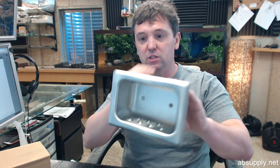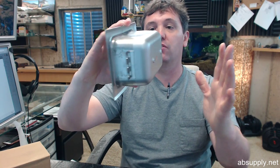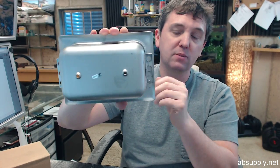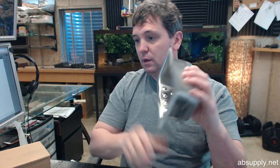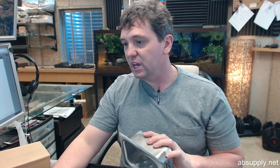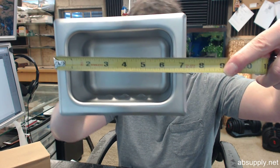Intended to be installed into a rough opening where you're obviously going to attach it through here back to some reinforcing. These little ears or tabs that you have here are generally used when you're going to do a wet installation and you're going to insert this into a grouted mud sort of application. But screws are included. There is a link below this video to a document called the product tech sheet, and it will give the important dimensional properties of the item.